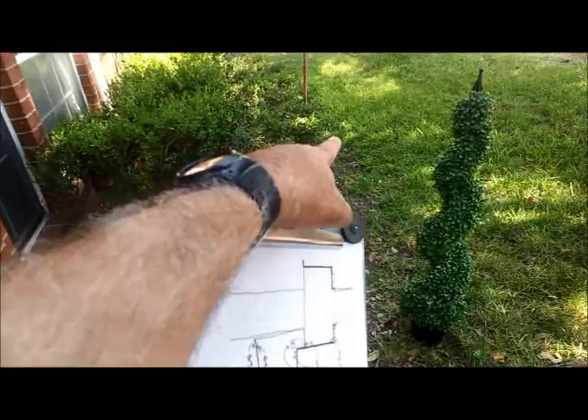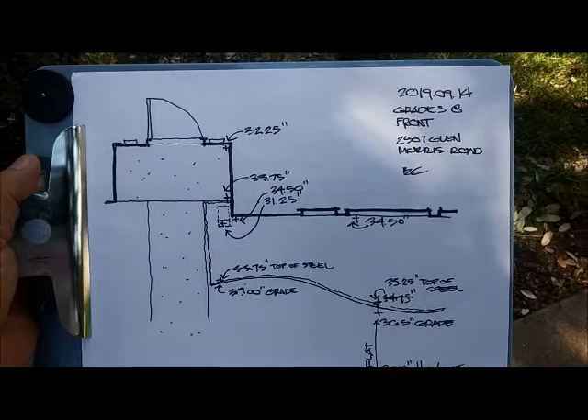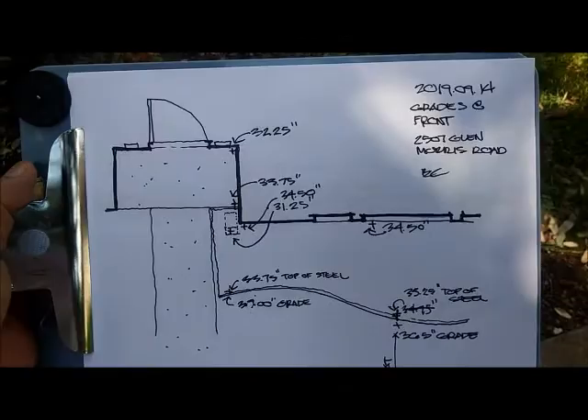I found out I'll be able to run my new downspout line over here and across — I have just enough grade to make it work. You can use this method to shoot grades for any close-proximity work. Within about 15 to 20 feet, a Fat Max laser level or any laser level should work accurately. Hope that helps with shooting your own grades.